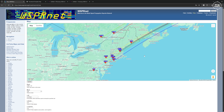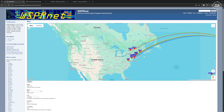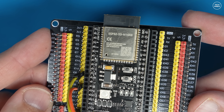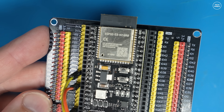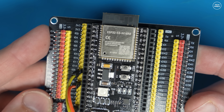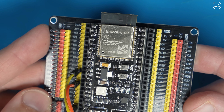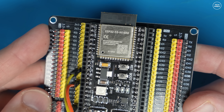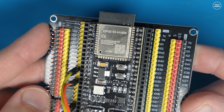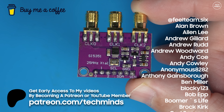With that said, don't let that stop you from experimenting — for less than £20 you can get a Wi-Fi enabled ESP32 module and an SI5351. You could make your own band filters and use my code to run it. I'll leave a link to my GitHub page where you can download it completely free of charge. In the future I may change the crystal to a TCXO and use GPS for time sync instead of an internet time server, or get rid of the web GUI and use a display with buttons instead.